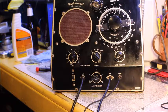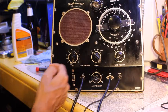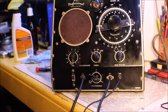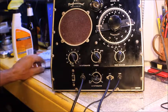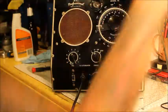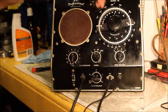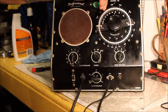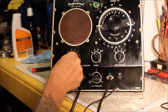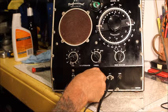Right now I just want to see if it fires up and if it picks up radio signals. The switch is in the RF mode; I have it on B, which is the lower end of the AM radio band. I'm going to turn my LEDs off because it seems like that creates a lot of static on these AM sets. The green light is lighting up, the magic eye is lighting up. It doesn't seem like it's balanced right — I'll get in here and fix all of that. There's a little scratchiness in these pots.